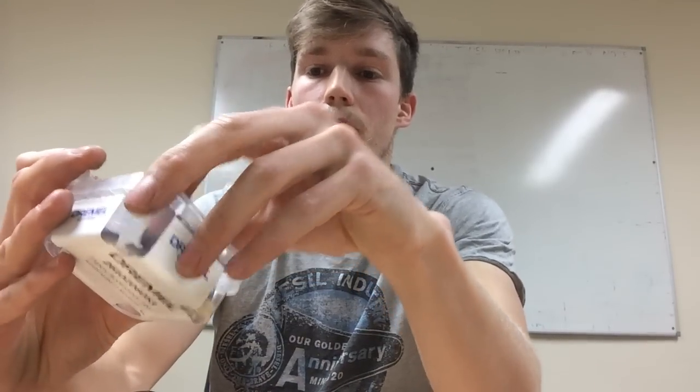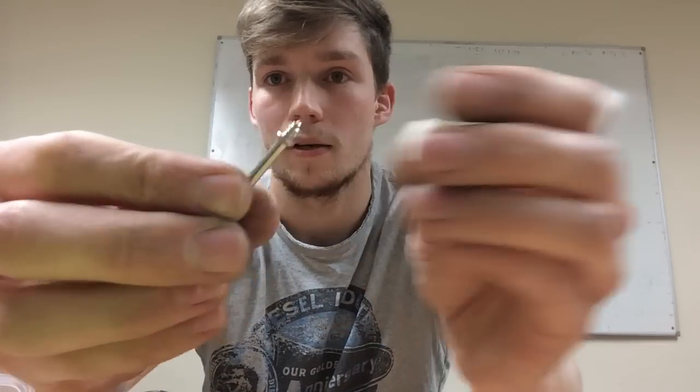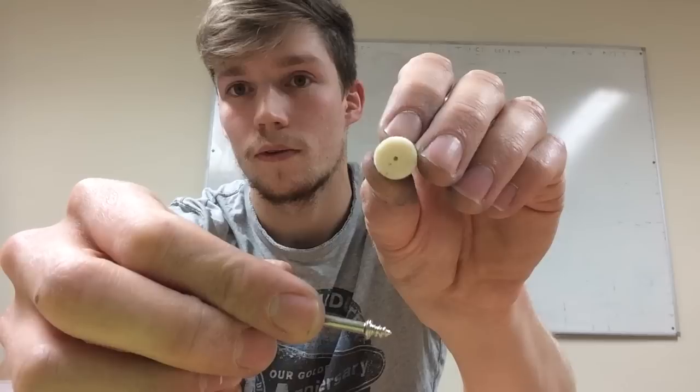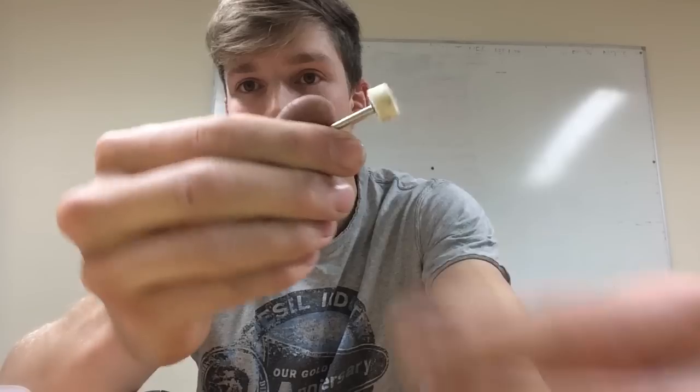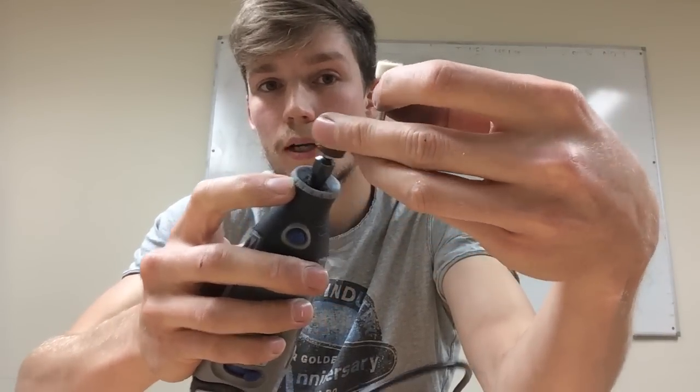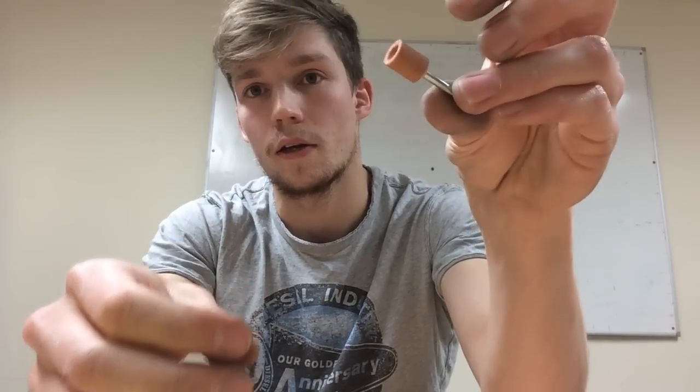The set also comes with a little polishing wheel. If you're using polishing compounds to polish metal or lacquers and you want to do small detailed work for modeling, you can use that. It's pretty easy to fit — you get a skewer with a thread on it, find the little hole, screw it in, and because of the direction that the Dremel is spinning it continuously tightens so it doesn't fall off.